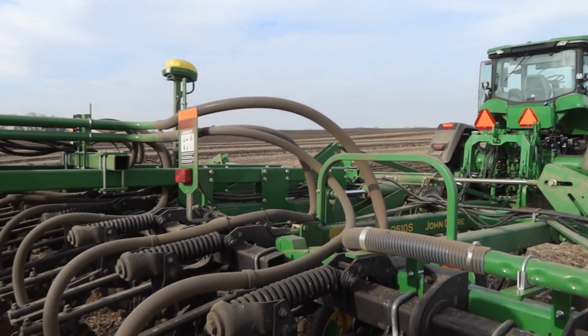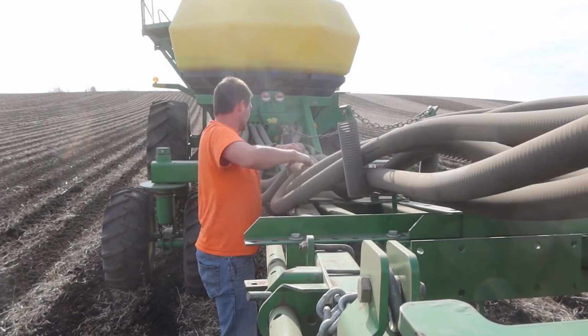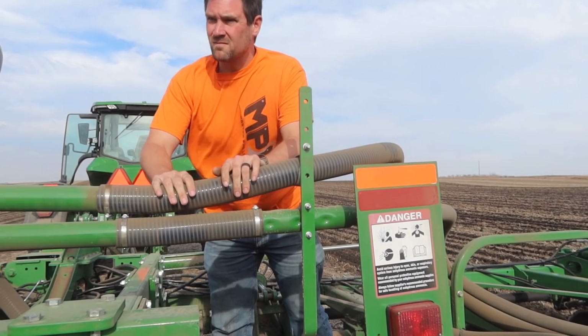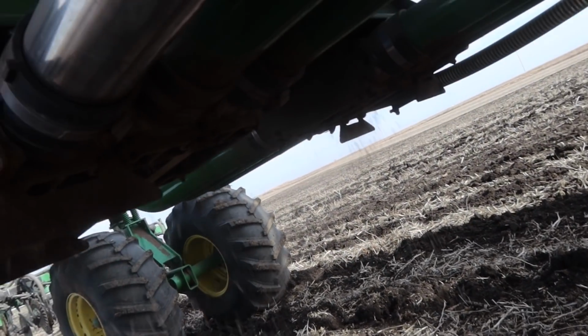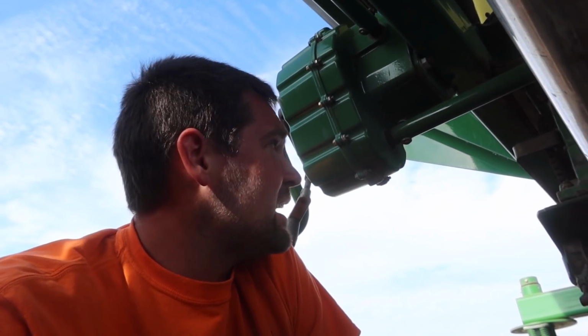It's probably somewhere in that one. That's full. There's no air to it. This one's flowing. When I spin the manual crank here, there's not product coming out of this far hole, which means this is not feeding this tube. You can see the tube sitting full of fertilizer right there, but it should still have been getting fed from the back. Seems like the tube might be plugged somewhere still. But the meter roll, that shouldn't affect that, and it's not feeding out right now.